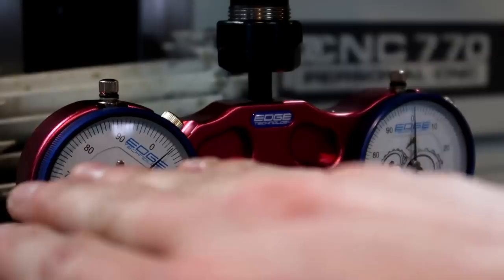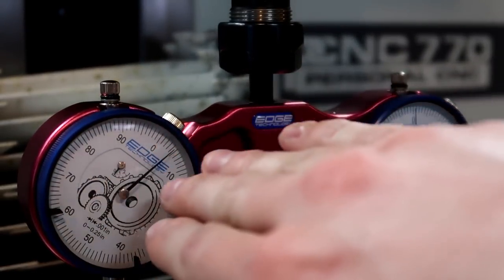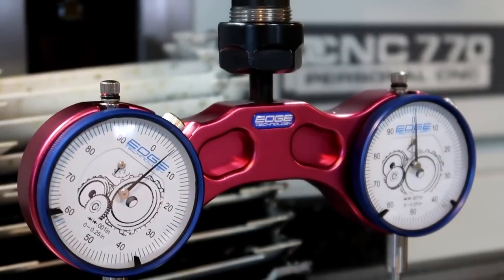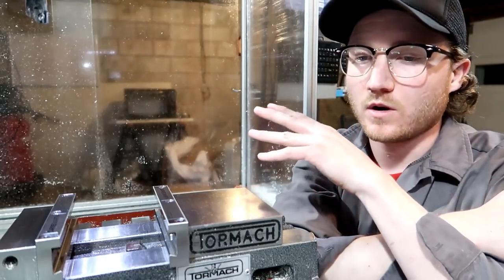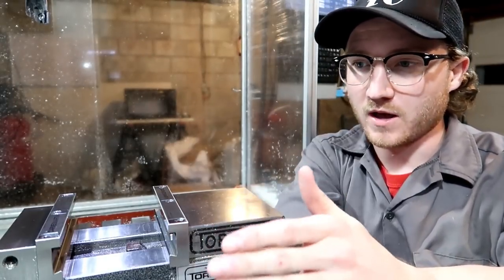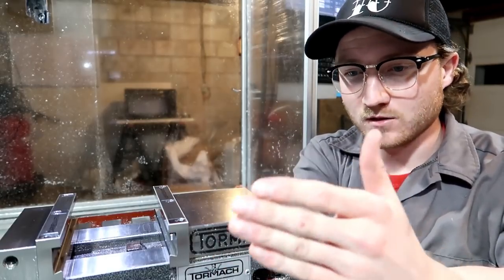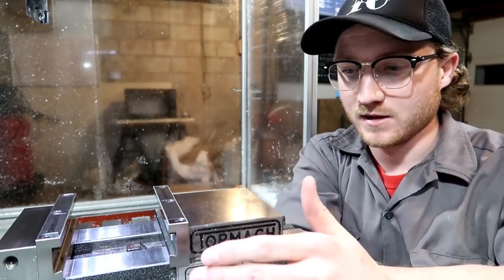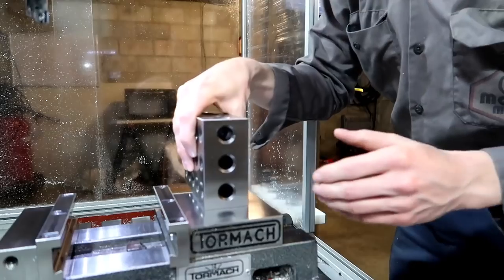That makes sense because when I cut left to right with the superfly, the back side of the superfly is at an angle and it's going to recut. To get to this point I checked literally everything — I contacted Tormach, checked all the gibs, kept them tight while maintaining the correct amount of lost motion in the table axes, and double-checked for twists in the casting.